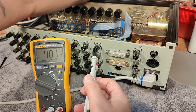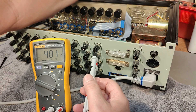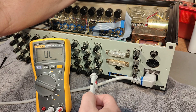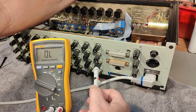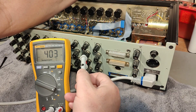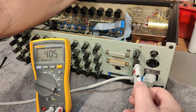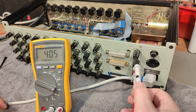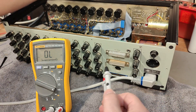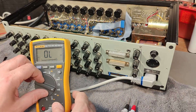Maybe it has something to do with the calibrate. That is weird — maybe it's between these two. Then it needs to be selected or something. We have 400 ohms between these two, and it's the same with everything else, so that means no matter what is selected I get 400 ohms. I would really expect those potentiometers to do some funky stuff, but obviously we need some of the others, and then between those they are doing their fancy thing.